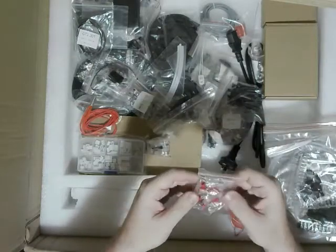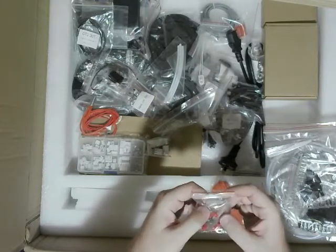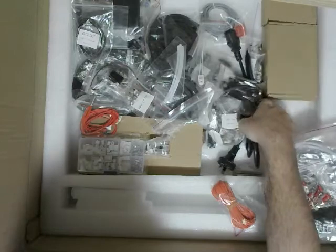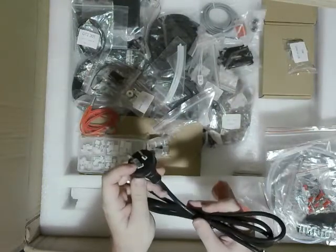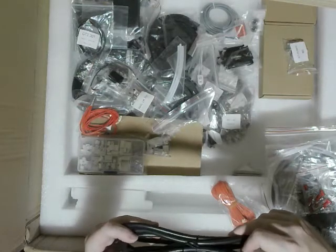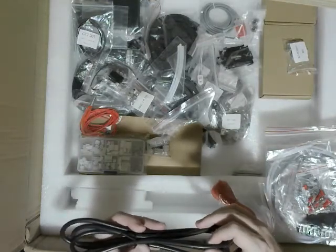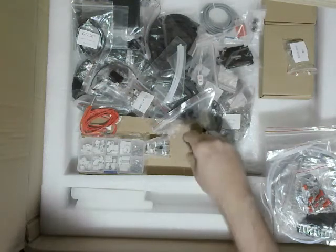Metal bits still on the tape. Spade lugs and the like. I see insulation separate from the actual crimping part, so that'll be for the mains side of life. We have a plug, Australia New Zealand style with the insulation, and IEC on the other end. 0.75mm conductors, so 7 or 8 amps. Won't take 10 amps, but the printer should not use 10 amps.